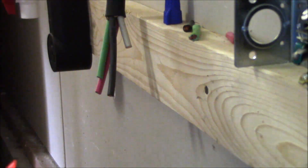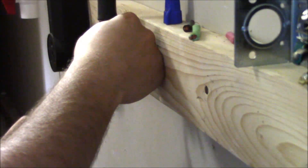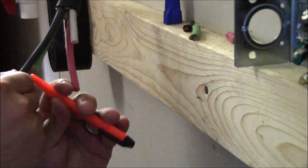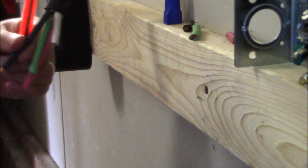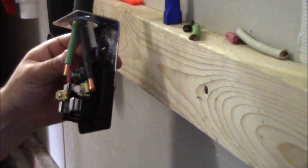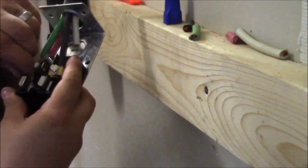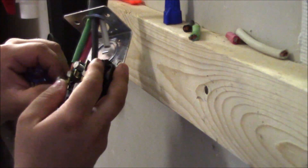Before I stuff them all in the box, I'm going to strip these. Use common sense — don't cut too much. No more than you need, maximum five-eighths of an inch. Most boxes that these plugs come in have a wire stripping guide for the correct length. As far as which conductor goes on which side, they're both supplying the same power — it does not matter. What does matter is that you get the two hot conductors on the sides and the ground in the middle, because that's the way it's connected in the panel.